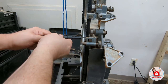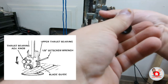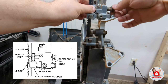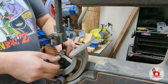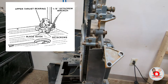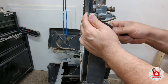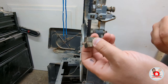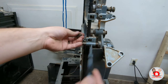These guide blocks on a lot of bandsaws are bearings, and the bearings are kind of a better design, but the guide blocks seem to work okay. I've purchased some graphite-impregnated guide blocks that seem to help quite a bit. These pictures popping up on the screen are directly from the manual — they show where the guide blocks are and how to set up the bandsaw. It's important to start from zero to make sure the bandsaw blade rides on the wheels where it wants to, and then we'll go back in and set up the thrust bearings and the graphite-impregnated guide blocks.